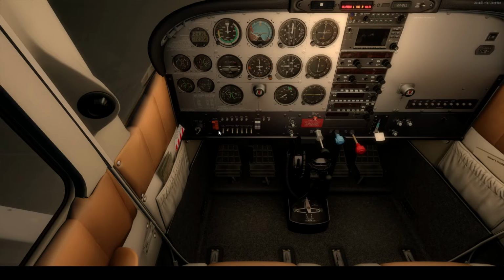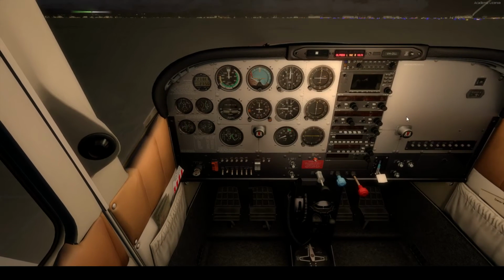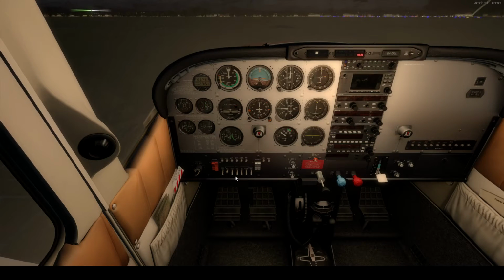Beacon on. Let's prime this thing a little bit since it is a little cold out here. I'm going to check what it is. 26 degrees. Actually, we might not need to. Just crack the throttle a bit more than usual. Crank it and see if we can get the thing to start. Actually, this is nothing like a Cessna 172, so we have to prime it. That would be around 5, but let's crank it up. There it is. Like a charm. Flip on the generator switch.